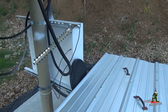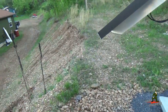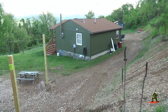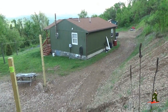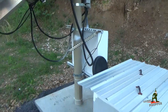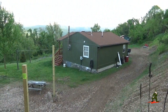The solar power project — even though it's completed, phase two will be putting conduit in from here all the way down to the house just below the electrical panel. I'll have to pull a whole new set of permits for that phase two job, because now it's going to involve alternating current and a conduit run coming up here. We'll bring it into the bottom side of the Hoffman box and then connect the inverter permanently down to the house where the manual generator transfer switch inlet is.